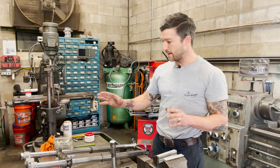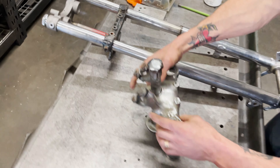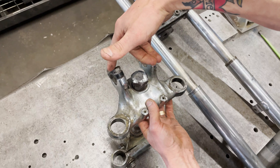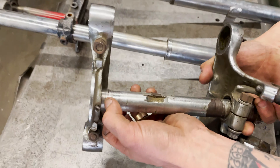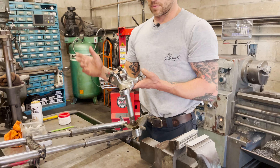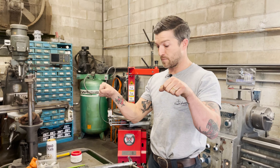Today I'm working on this fun project — an early Sportster front end, K models, and we're going to retrofit it to fit these trees, which I believe are later Triumph '66 to '69 trees. The reason we want to do that is these are slightly narrower, so it's going to narrow the front up. We also want to run some 7/8" handlebars, and it has this built-in cool riser cast 7/8" handlebar deal. We're going to have to machine this little guy off the stem — this is already one inch, so a one-inch bearing should fit fine. We're going to have to bore the diameter of the lower tree out because that measures 32.7 and it needs to fit a 33.4 front end. I think it's going to be cool to have this style riser built into the top tree — it's going to bring the handlebars a little closer to me on the bike.